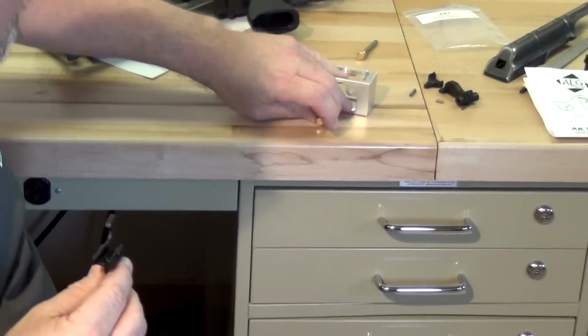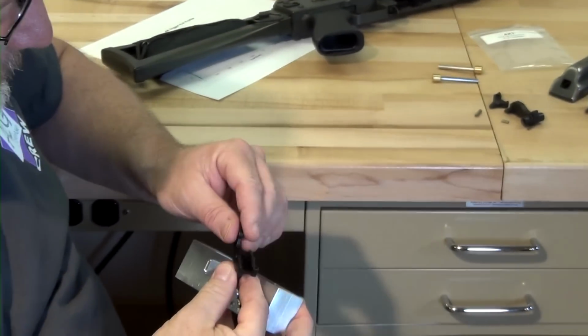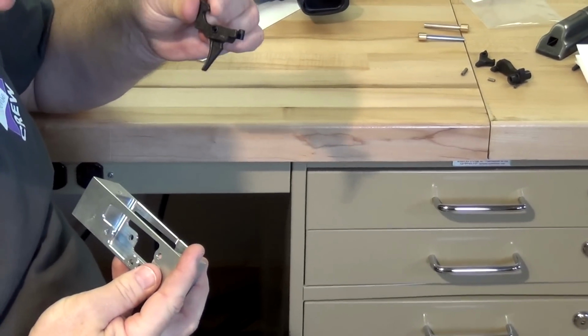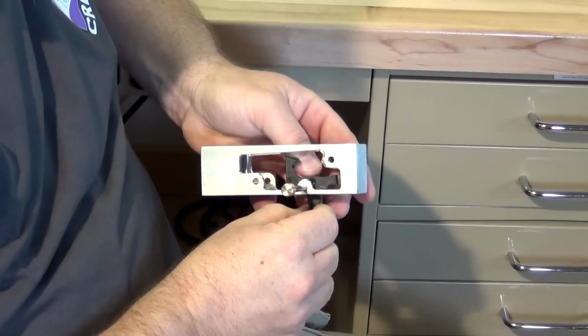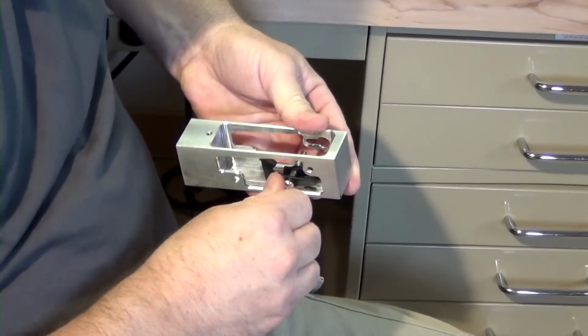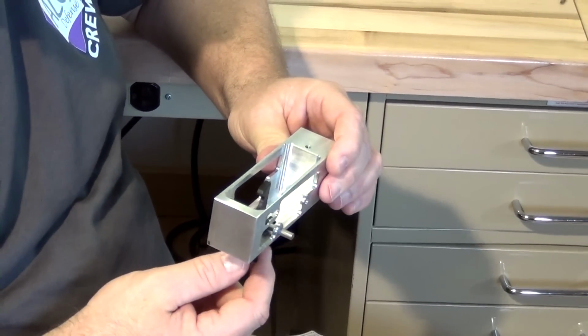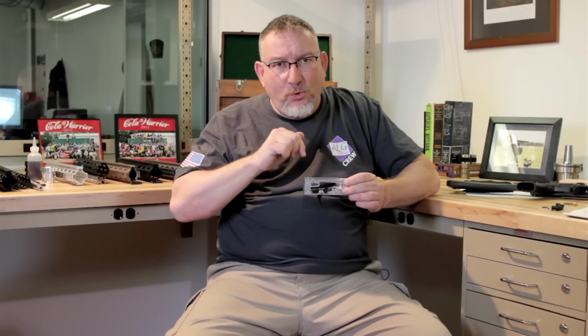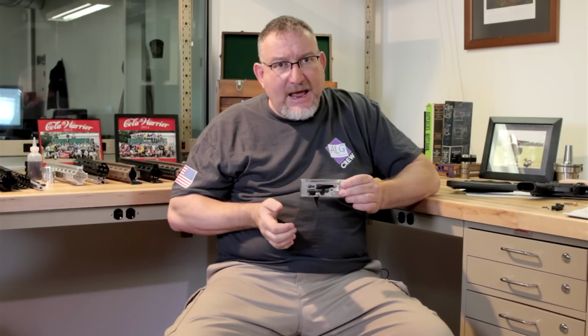When you go to do this on your gun, the first thing you do is install, just like here, the bare trigger with no disconnector on it. You put it in here, and we have these alignment pins instead of regular pins right here. And you fit your trigger in. First thing you look for on your gun is to make sure that this trigger rotates freely. The holes in an AK-47 receiver are stamped or laser cut, and there can be some inaccuracies there.